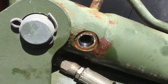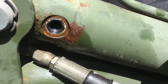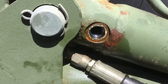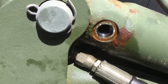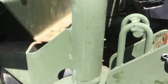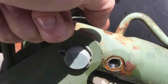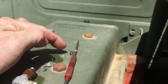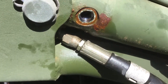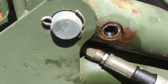But you can access it. You can push on the ball and feel the spring on the back side. You can actually feel it moving when it is free and clear — it should move freely when you are pushing on it with a probe. That is what you want. It looks like the ball is balanced between the innermost spring back in the assembly and this spring right here. The ball kind of hangs in the balance between there. When it gets too much flow by it, it seats against the seat and locks up the cylinder.